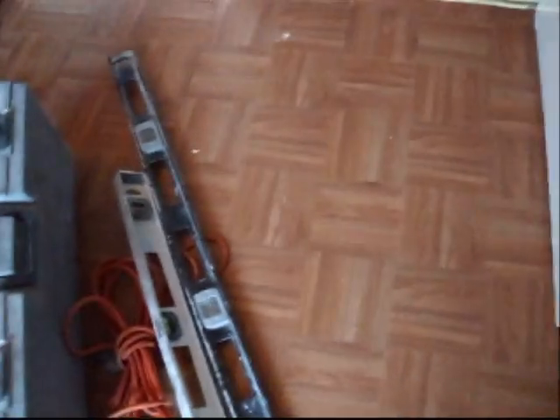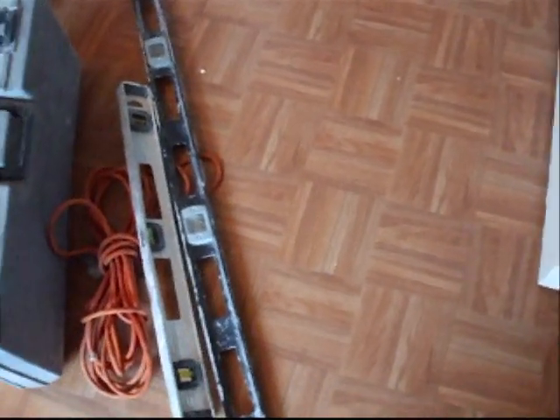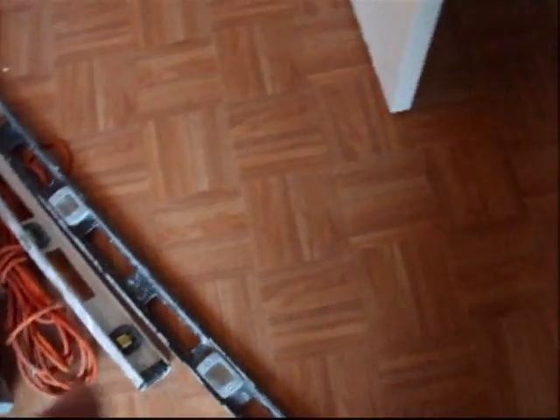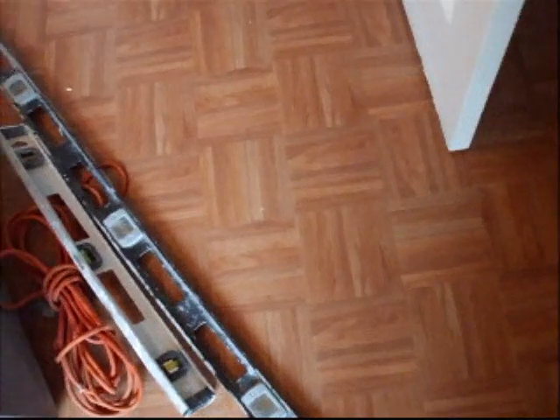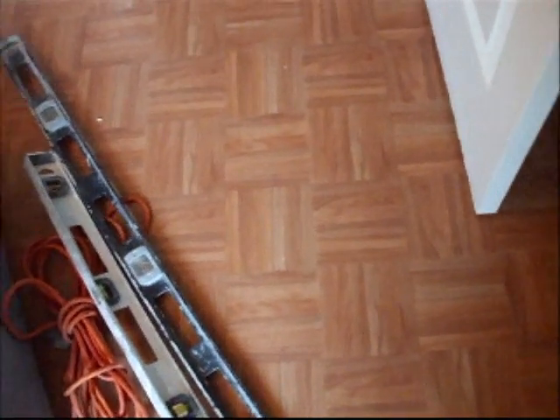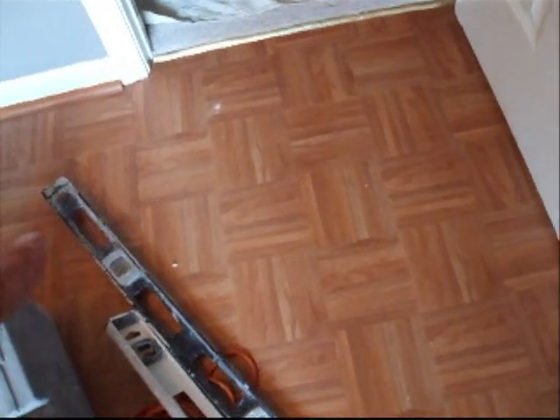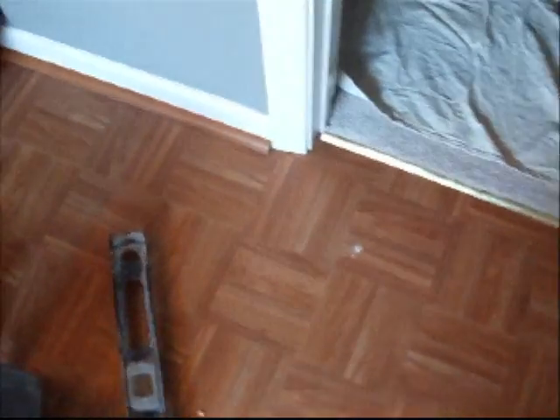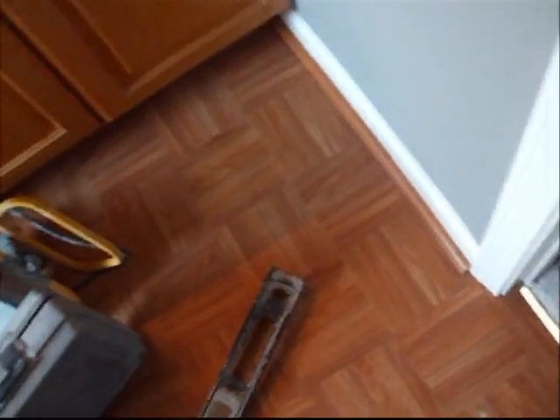This was put on relatively good, but it's still crap, and I'm going to be tiling this floor eventually. Rather than take all this sticky stuff off, there's three-quarter ply under here as a subfloor, so I'm just going to nail on my DuraRock — quarter-inch DuraRock — straight onto this. Since I put about 50-60 nails in each piece anyway, it'll be irrelevant and it'll save a lot of time and energy trying to take all this stuff off the floor.